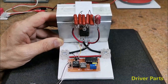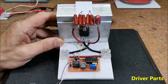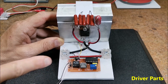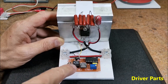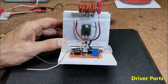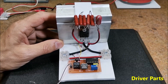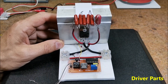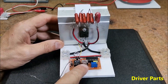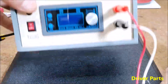The calculated resonance frequency of the secondary together with the top load is about 260 kHz and in practice somewhat higher. The driver part consists of several components: an adjustable Schmitt trigger oscillator with a range of 50 Hz to 2.5 MHz made with a 74HC14 hex inverter integrated circuit, then a TC426 cheap MOSFET driver integrated circuit, a powerful MOSFET — I use BUZ325 but it is better to use the more powerful IRFP460 — next a polypropylene capacitor with a capacity of 1 nF or more depending on the tuning, and a 7805 voltage regulator.